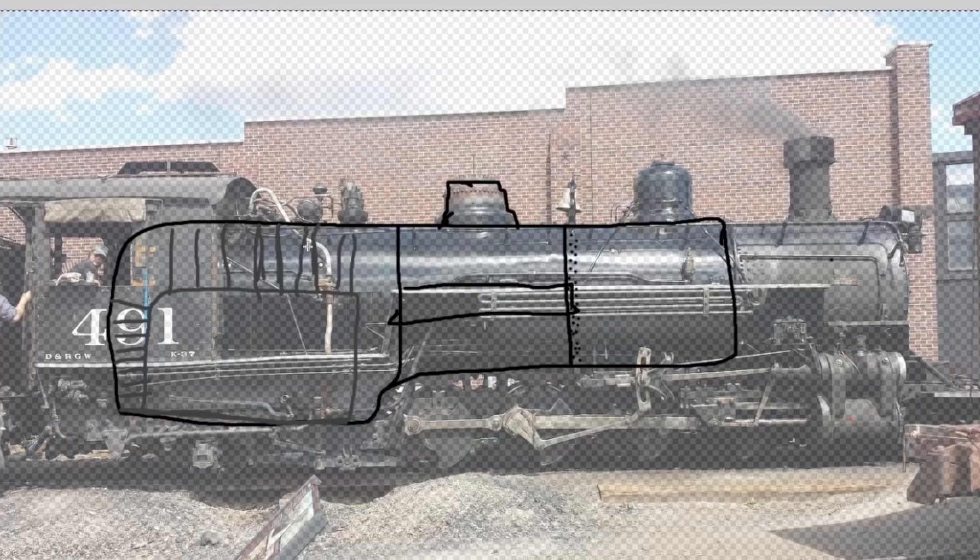There are also flexible bolts — bolted into the firebox but with a big head on the outside that allows the sheet to pivot around. When you have a whole grid of these bolts, the sheet is constrained just as if they were threaded, but as you expand and contract — because the boiler grows with temperature — you get that motion without breakage. An important feature of these bolts is that they're drilled all the way through and hollow. If one breaks, water will leak out, clearing blockages due to high pressure, so you'll see leaking water and know you need to go fix something.